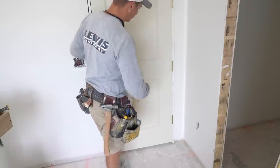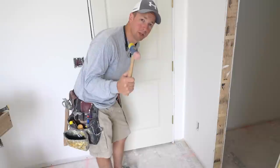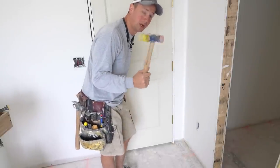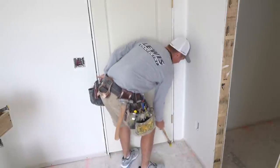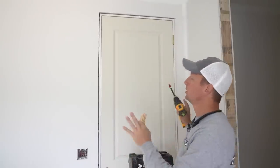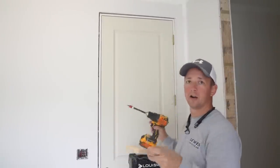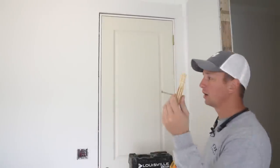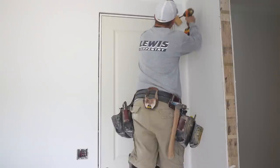I try and get the four corners somewhat close to being flush with the drywall. If you're going to be a trim guy, you need to be able to abuse things without causing permanent damage — that's why I use a rubber mallet, because when hanging doors I bang on things a lot. One of the nice things about using the Jam Master and pre-shimming is once you put the door in the opening, friction kind of just holds it there. But here's a really good trick: just take a scrap block of plywood so it won't split, then come up here and screw it in.